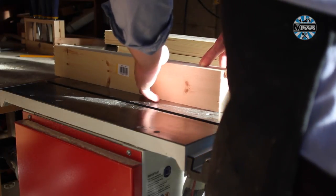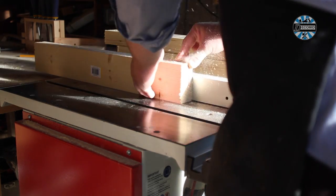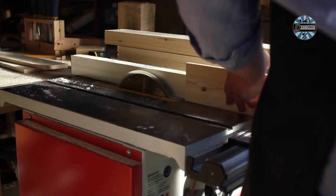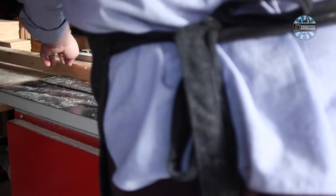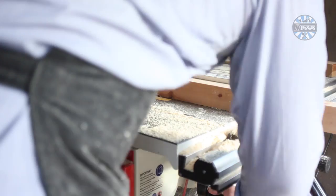These blanks are needed slimming down to make the pieces that I will glue up into panels. To get the depth right from these blanks, I cut three thinner panel pieces. The legs for the box will cover the jointing between the panels and help keep things square, just as I am squaring this off here.